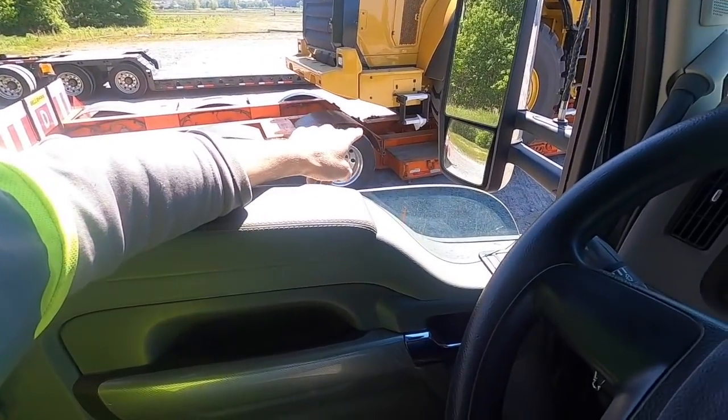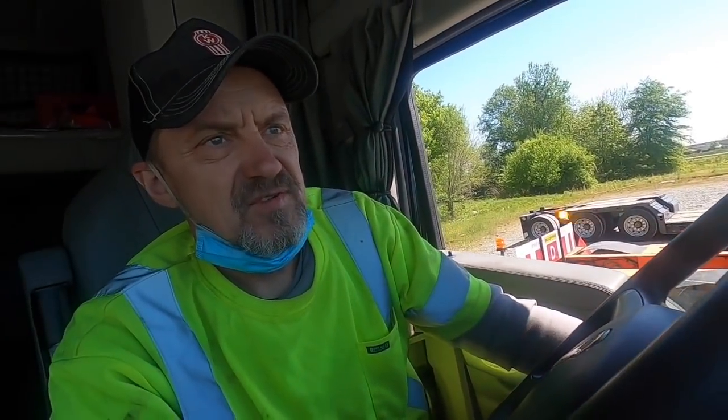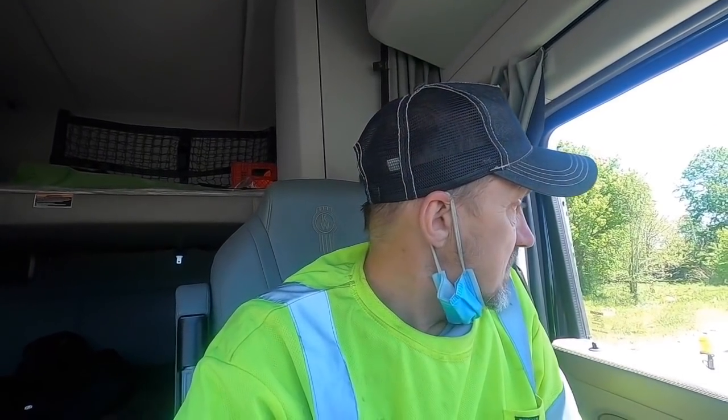And if you have a raised center, that blade would have to sit higher, and like on a 55 ton, the center was at 23 inches. I still remember 23, and the sides were, according to the marketing booklet, 14.5. But I could never make it that low, because that's designed for your fully loaded deck height. So you need to have 55 tons on the deck to achieve that. But with regular loads, what I was able to do with 7-8 axles, I think I was about 16 inches, which is still excellent, right?